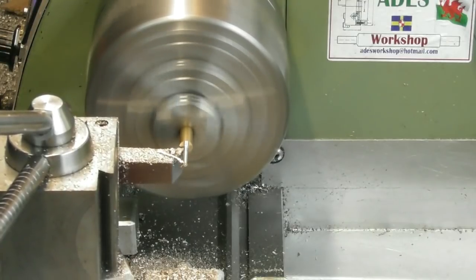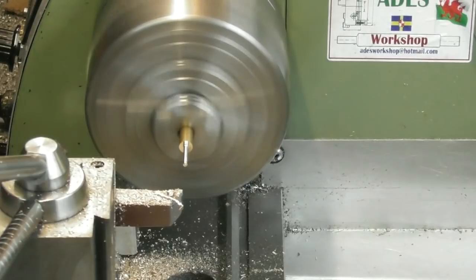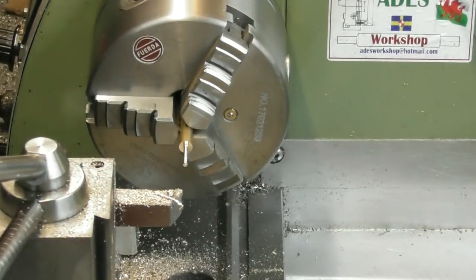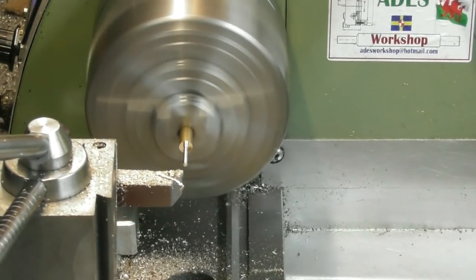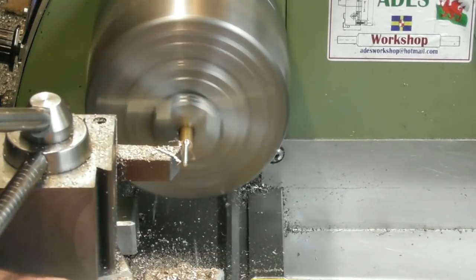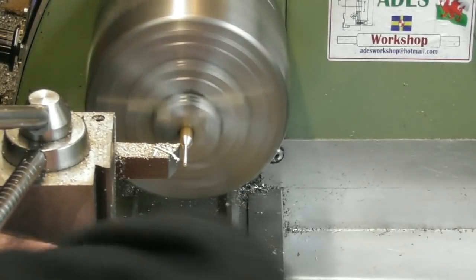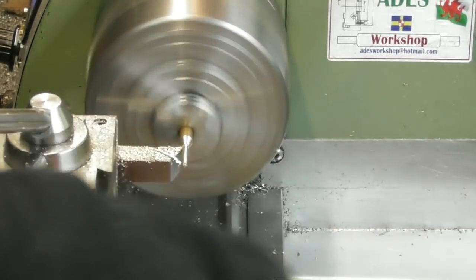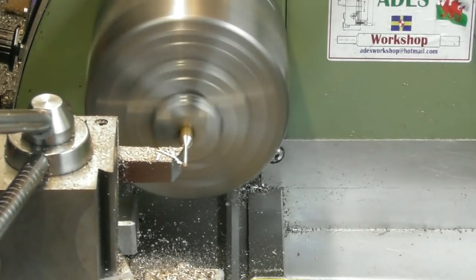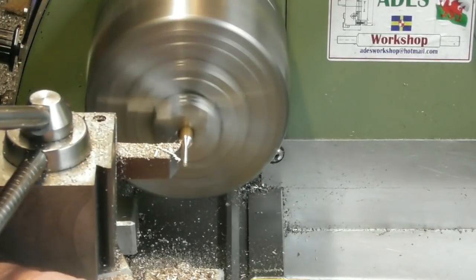There's fine hand-filing to be done here. It's not critical — it's just the basis of the action end, shall we call it. At 2.05 that'll all come out in the polish. So from the back of the area I want to angle it out — I've got my compound set at 20 degrees. We don't want to leave a sharp corner with such a thin diameter; it's just likely to snap off. We'll give it a little bit more strength in that little area of the intersection.